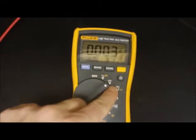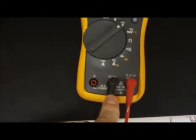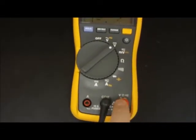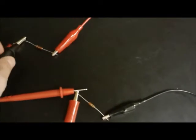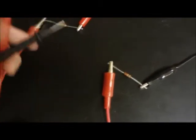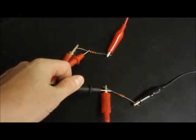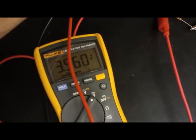To measure the voltage around the battery — what's coming from the battery — we're looking at the entire circuit. Set the multimeter on direct current voltage, that's the solid line and the dotted line underneath it. Have the black lead into the COM port, red lead into the side that says V for voltage. You have to find the lead closest to the negative terminal of the battery and the other side closest to the positive terminal, before it ever goes through any resistor. Touching both parts on the side closest to the power supply gives a read for the overall voltage provided by the battery.